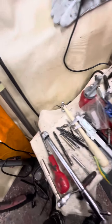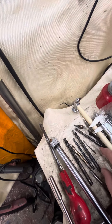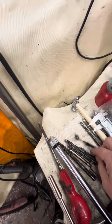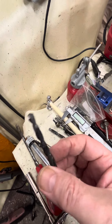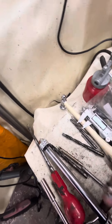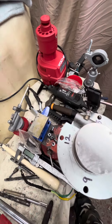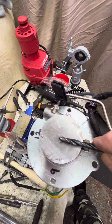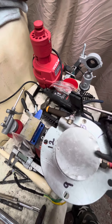You're also going to need a huge selection of drills. You're going to need to start off with like an eighth drill, then I think I went up to 4mm, then up to 6mm. You want to go all the way through with the 6mm, because if you look at the tip on a glow plug, that's the bit that's going to be sitting right in the middle of the chamber. So make sure your 6mm goes all the way through, so when you go to fit your glow plug in, you don't snap the top of it off by hitting on something.